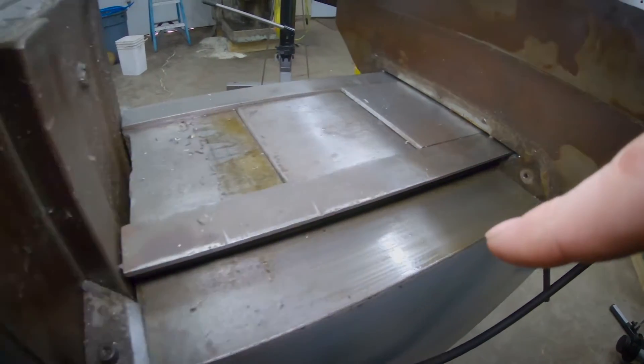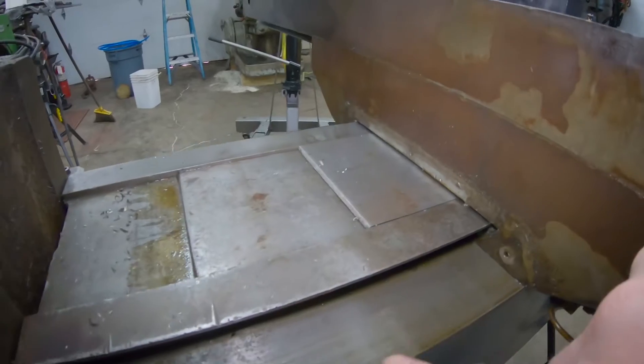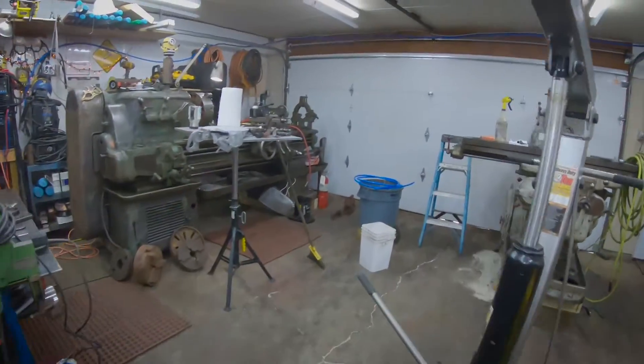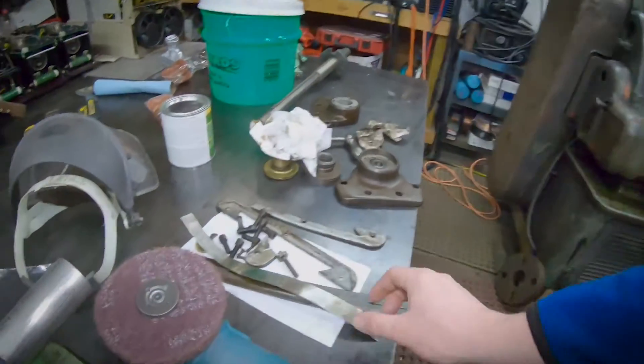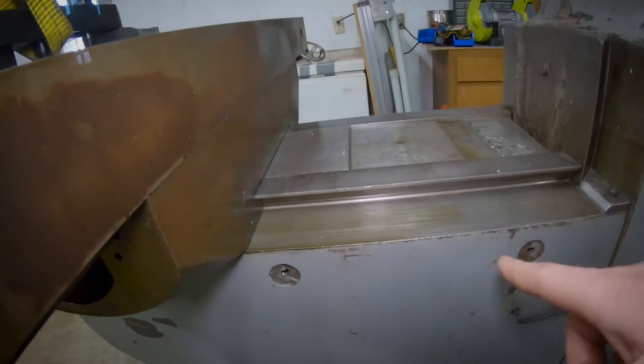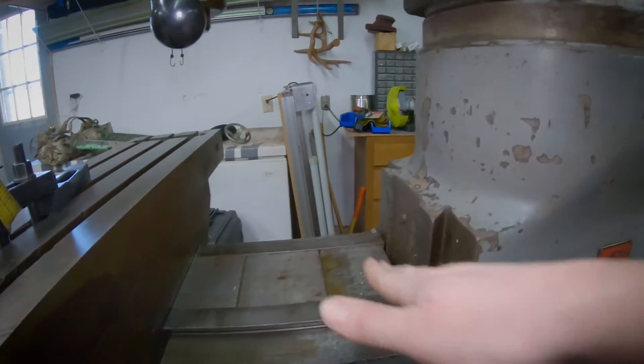As you can see, this side of the knee here is pretty gnarly. You can see some scraping back here but right in here is really heavily worn. I just pulled out the gib for the table and it has been shimmed, which tells me this thing is worn pretty good. This side is not worn to the same extent, which makes me wonder if the table is tilting a little bit. I did run an indicator with the table back and forth and it was holding about a thousandth and a half, and the same goes for in and out on the Y.